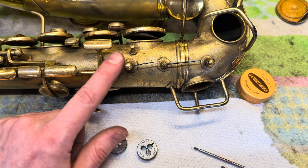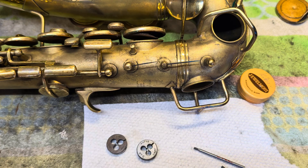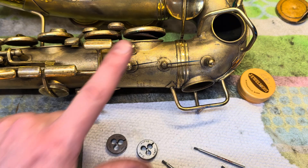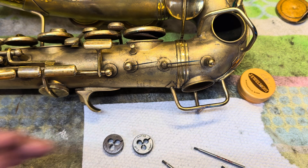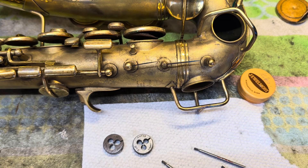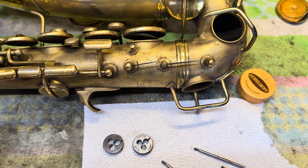If you're looking to get threads much more like the originals for your vintage American horns, get the NC and NF taps and dies, not the UNC and UNF. Hopefully you found that helpful, useful, and informative — this is something that's been driving me crazy forever. I'm so excited to finally be making screws that match and feel like the originals, and it was something so simple right under my nose. I've confirmed it empirically, as you just saw, and also on the original King Super 20 factory blueprints, which say right on them '3-48 NC.' My name is Matt Storr — I repair saxophones for a living. Thanks for watching.